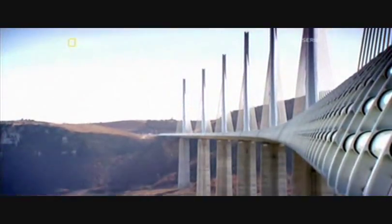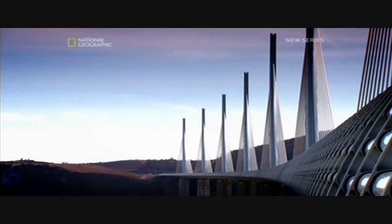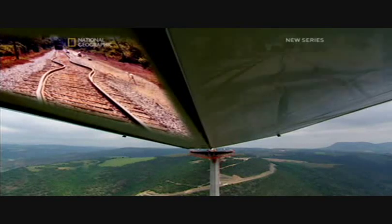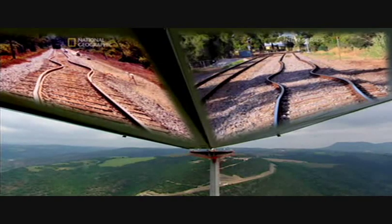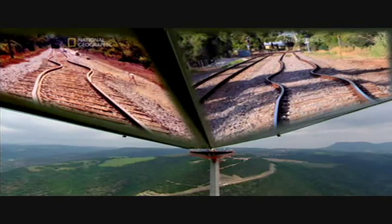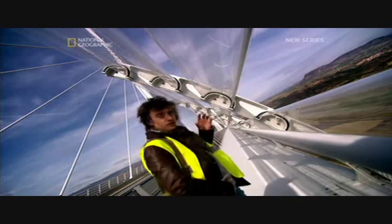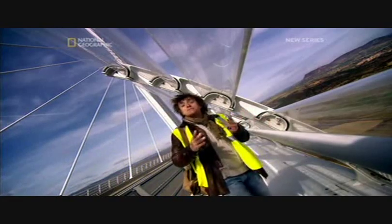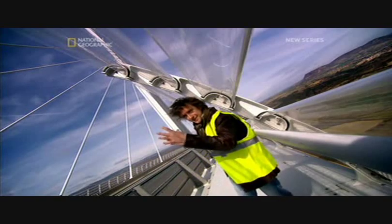The tiny expansion in this demonstration scales up the more metal involved. Rail track can dramatically expand in extreme heat, and with nowhere to go, it inconveniently buckles. If this were to happen on a bridge, it could be a disaster. On your average bridge, you leave gaps — expansion joints — to accommodate movement of the deck with changes in temperature.